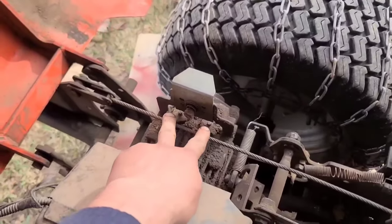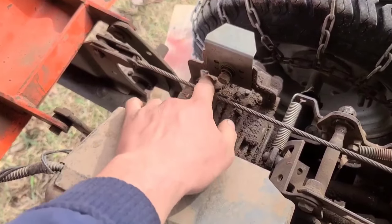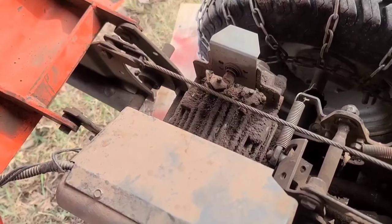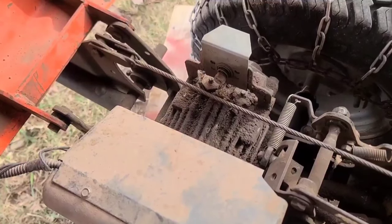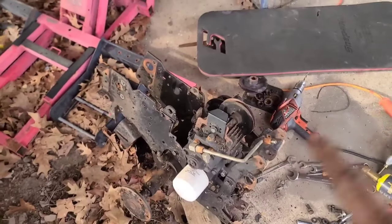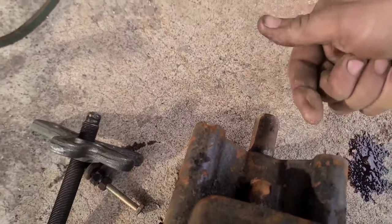The other problem is one of these check valves was bad. I'm not sure which one it was, but I reversed them so at least the forward would work. When you go downhill it gets air and has somewhat free movement, and these valves are like $250 new. So rather than buying new ones, I'm going to swap them from this parts transmission. I also have the beveled gearbox I'm going to send out - the input bearing is bad, so this shaft is actually going in and out.